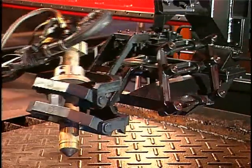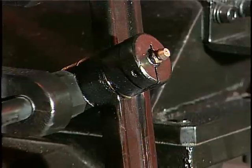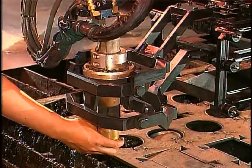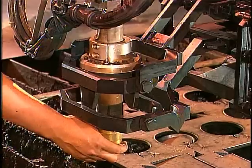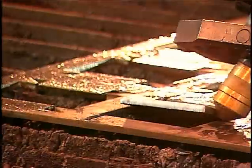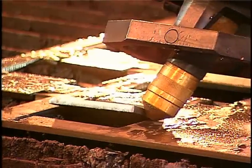The 3D-Link allows for simple torch alignment and lubrication fittings, ensuring a long life and dependable operation. A magnetic breakaway collision protection system protects the cutting head and is fast and responsive. It also has a protective guard to sense tipping of parts.